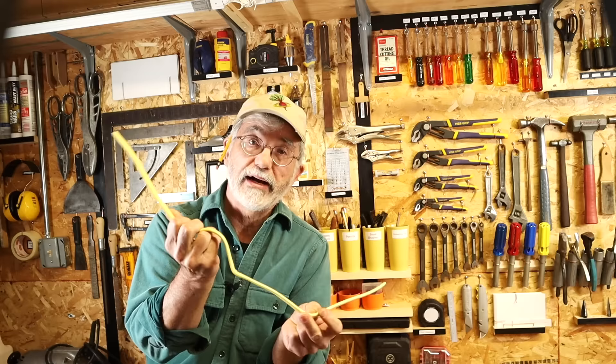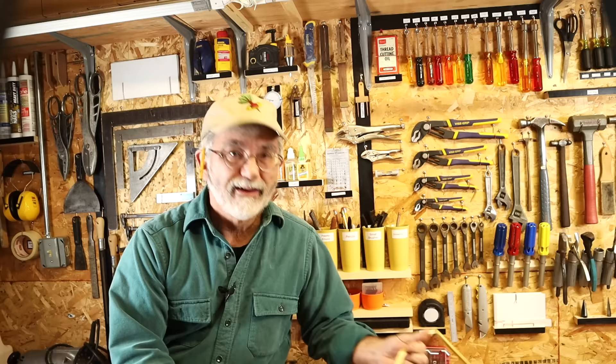Hello, I'm Herrick Kimball and today in this video I'm going to show you how I have easily and very inexpensively organized my tools on the wall over my workbench like you see behind me here. I have not used pegboard, Kaizen foam, French cleats, and I haven't purchased any factory-made store-bought organizational accessories. What I have done instead is hung my tools up using scrap pieces of 12-gauge Romex electrical wire and number 8 by 3/4-inch panhead sheet metal screws, both of which I had on hand. I'm also going to show you some other very inexpensive, or free, tool organizing ideas integrated here with the copper wire hangers.